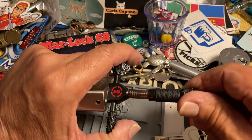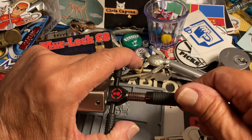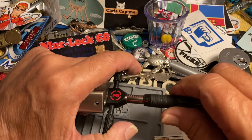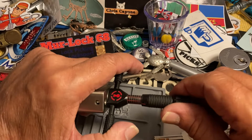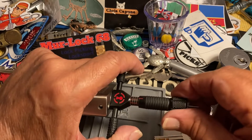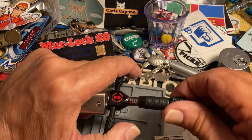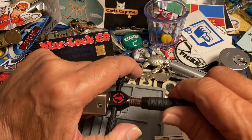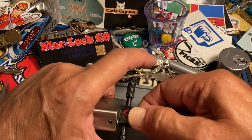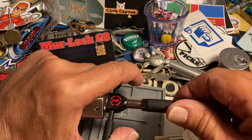Let's tension. I got a click, so let's keep going. Next one. Didn't really feel the feedback. I put it back. All right, let's go to the last one, see if we make sure that's set at zero. Okay, that's at zero. So what we want to do is try and get some tension on these discs. And sometimes it helps — there's some movement in here, you can move that around — and maybe that's gonna put a little more pressure of the discs into that sidebar, or not.